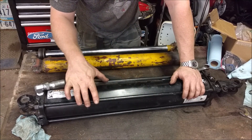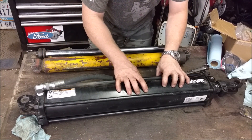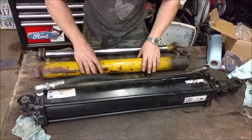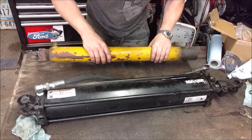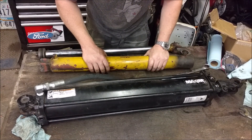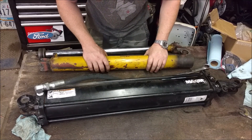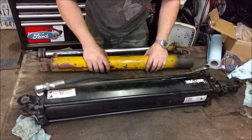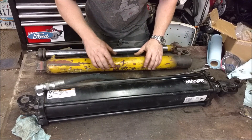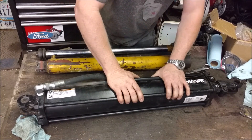This is what's called a tie rod cylinder because it has these tie rods that hold it on. You've got a machine tube in the middle and they just put these two end caps on, versus what's called a welded cylinder. Welded cylinders are usually for high production applications where the machine manufacturer needs the same thing over and over — custom size, custom bore, everything else. It gets cheaper in the long run to do those versus tie rod cylinders, which are cheaper to do for onesie-twosies here and there.